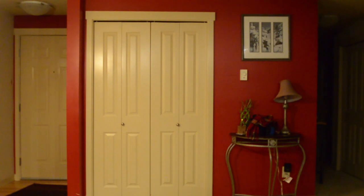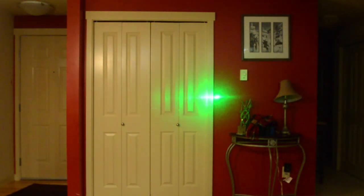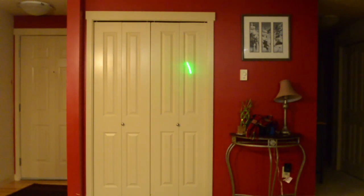The laser by default runs at about 800 milliwatts — I know it says it's a 1-watt laser, but it's not going to hit 1 watt; it's less than 1 watt. When you turn it on with the lens cap on — the 80% reduction lens — you're getting about 150 milliwatts of output on full power. If you put it on low power with the lens cap on, you've dropped it down to about 30 to 35 milliwatts, which is a fairly high-end laser pointer. This is not eye safe — I still wouldn't shine this in anybody's eye — but I can look at the dot without my laser shades pretty safely, and I don't have to worry about getting headaches from looking at it too long.